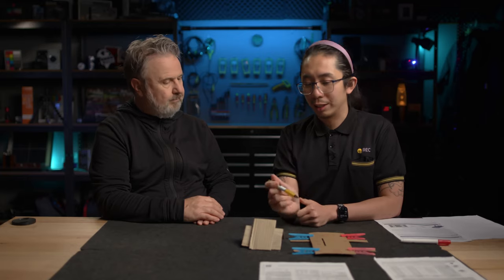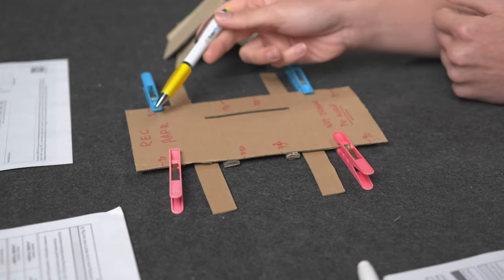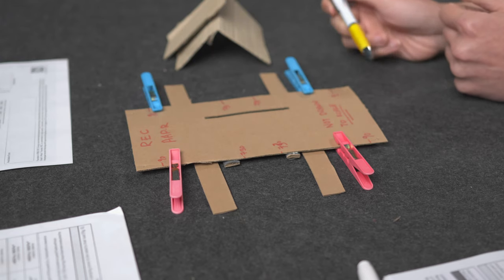Okay. And the reason is just because of this. I also went to put in these holes, as you can see in the corner. These holes are what we call the drainage holes. The main reason we don't say it's the whole 0 to 730 is because if you clamp here and your panel gets clogged up with water, that's going to be a problem. So that's why we don't recommend anywhere from 0 to 90. It's more to not block up the drainage holes. Ah, I never realized. Okay. Yeah.